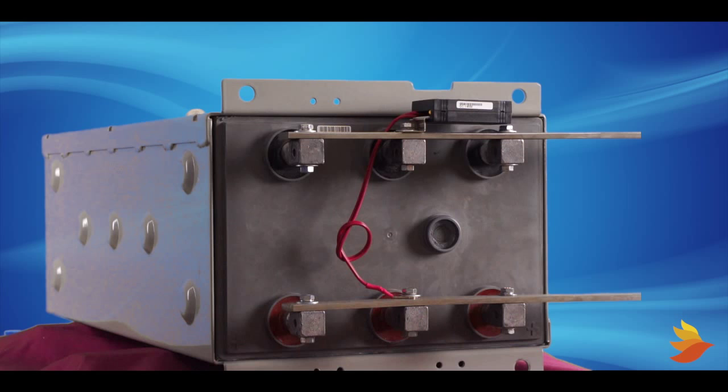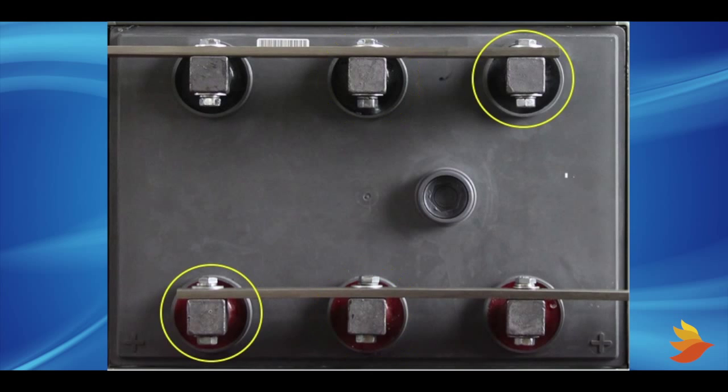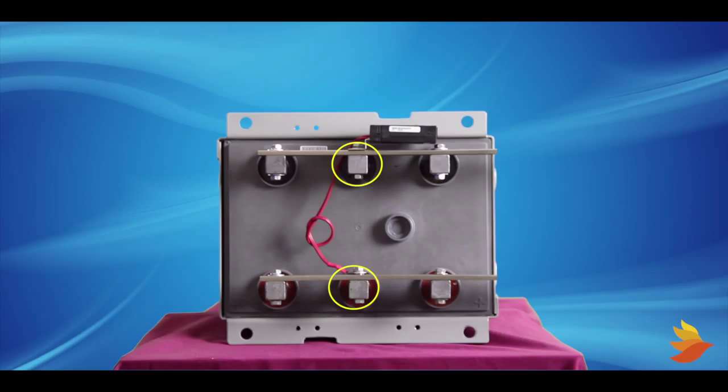Today's installation is focused on mounting a PBT sensor on an individual 2-volt cell. Consistent sensor placement is a key consideration. On a 6-post cell, for instance, we can attach the sensor's terminal ends to the cell in different configurations. Note that manufacturers sometimes specify which post should be used for measurements. Whichever you use, be consistent throughout the string, and throughout all your installations.